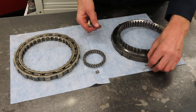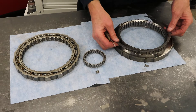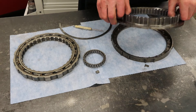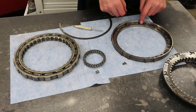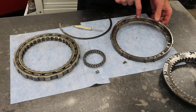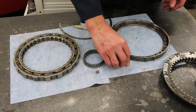The diode type — I've cut away the little retaining ring. This one-way clutch is out of a General Motors 6T40. I'm going to lift this out and look at these elements. Here's one of them — it's a really delicate piece. Each element sits in a little saddle or seat, yet it's able to roll one way and then lock up the other direction. You don't see people taking these apart because there are so many little intricate pieces.